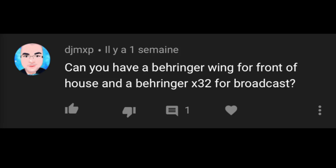The first question today is from DJXMP: can you have a Behringer Wing for front of house and a Behringer X32 for broadcast? Yes. All you need to do is connect the consoles together over a Cat5e shielded cable so they will speak AES-50 — AES-50B from your Wing to AES-50A of your X32 — and use that to do your mix. Use the USB out to send to your computer for broadcast. Just be aware that you won't have gain control; the first console in the chain will have gain control, the preamp control. You have a 20dB trim, plus 20 minus 20 — that's the only gain control you'll have on your broadcast X32. Or if the X32 is your main console, the Wing will only have the trim setting, not the preamp gain control. It's not like you physically split the preamp; it's just gain sharing.